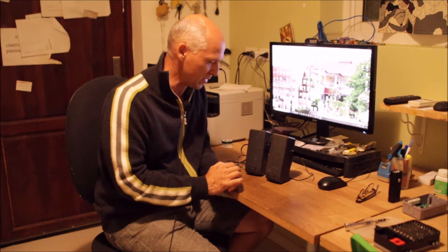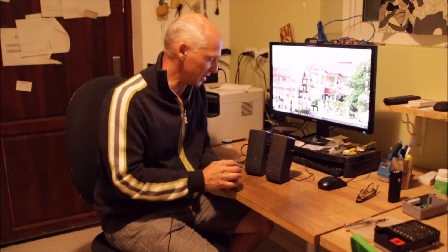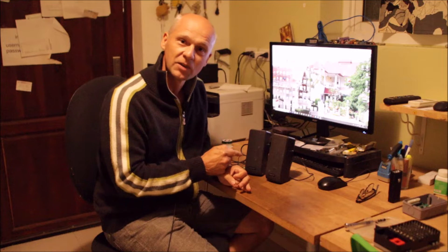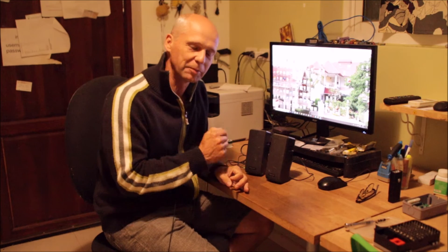So why do these loudspeakers sound like this? We're going to fix them because this is a very easy repair. When you have an electronic device powered from the AC mains, the electronics itself runs on DC. Something converts AC to DC, and when you can hear the AC pushing into the DC, there's a problem with the DC power supply. My educated guess: it will have something to do with the output capacitor.